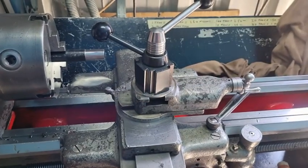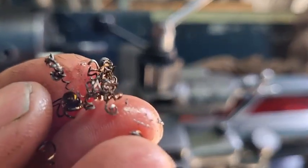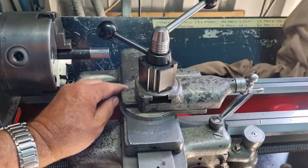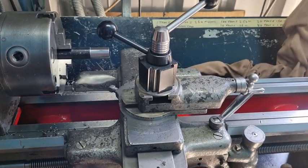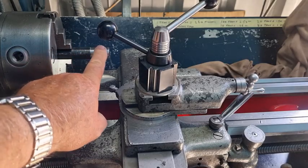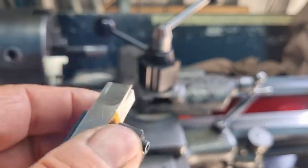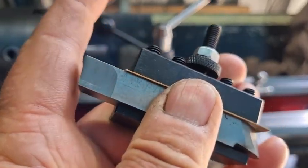If you go closely and have a look — this is what I mean by a chip breaker. It's just all small chips, no long bits. That's what a chip breaker will do: it breaks them off into tiny chips. It's working okay and it's a reasonably smooth cut. We'll set it up, put it back on there, put a bit of oil on there and do a run. This steel here turns horrible, but it comes up reasonably good using the chip breaker on the high-speed steel.